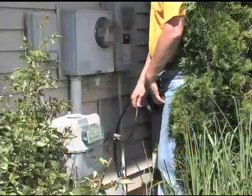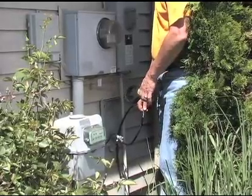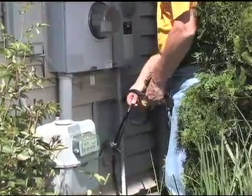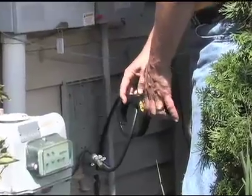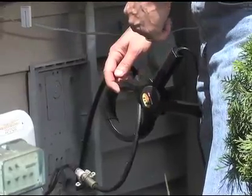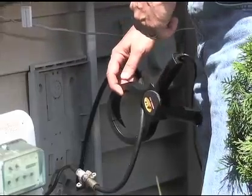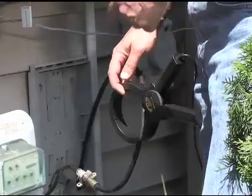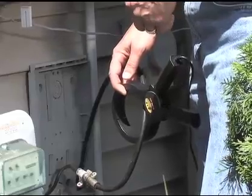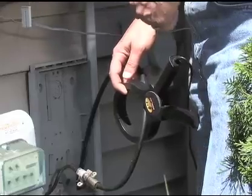An alternative way to connect to a cable without disconnecting it is to use the inductive clamp. As shown earlier, plug the clamp into the clamp port on the transmitter, turn it on, and you'll get that bright red blinking LED. Then take the clamp and connect it around the cable. At this point, the clamp is inducing a signal onto the cable and you can track it. As mentioned, a couple of tips: both sides of the cable need to be grounded — you can't have one end sticking in the air — and you have to connect with the clamp placed between the grounds. The distance you'll get with a clamp is less than direct connection since you're inducing a signal, and you do have to use it in high frequency mode for the signal to induce into the cable. But other than that, you're ready to go.